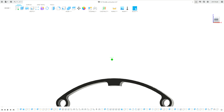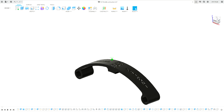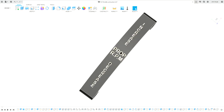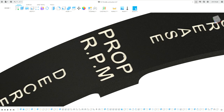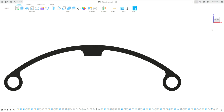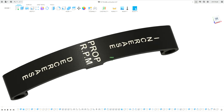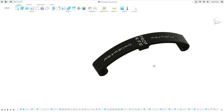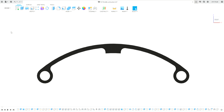These were originally brass, probably just extruded and cut to length. I'm going to engrave them rather than just paint them, and fill the engravings in with white paint afterwards. I haven't got any matte black spray paint at the moment, just white. These bits can all be cut out of aluminium plate — they're originally brass but I can't get any at the moment due to lockdown/coronavirus, so I've got aluminium and they're painted so you'll never know any different.